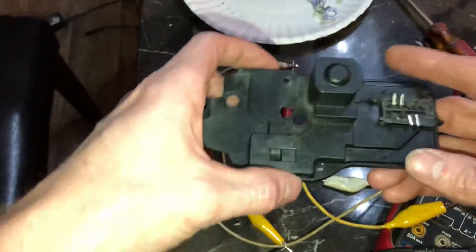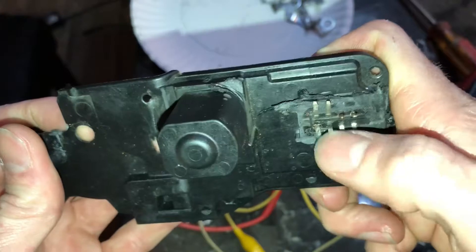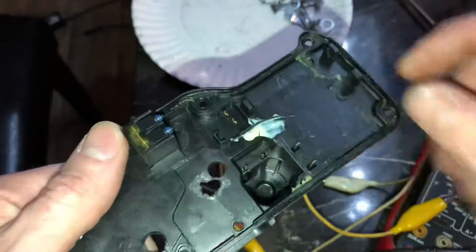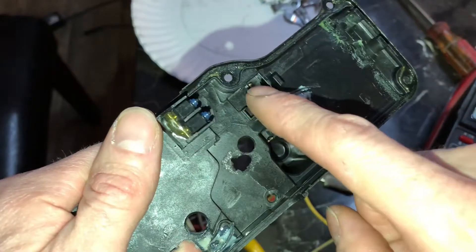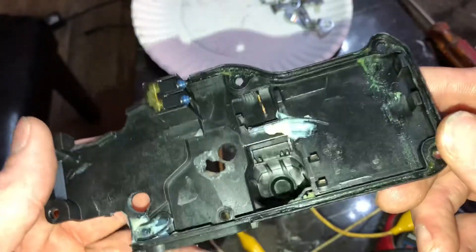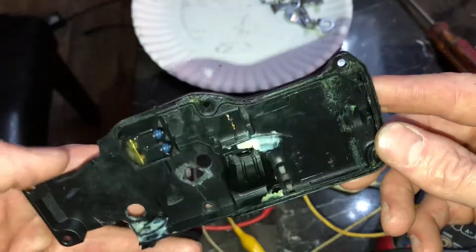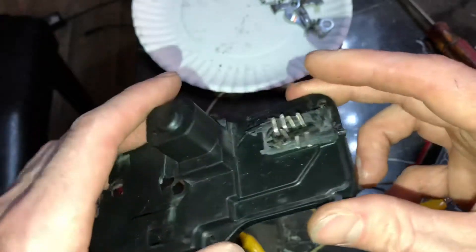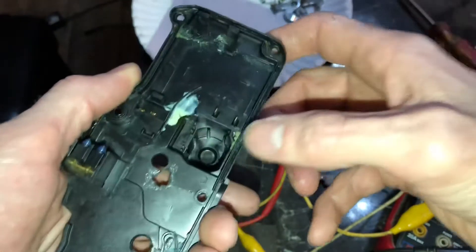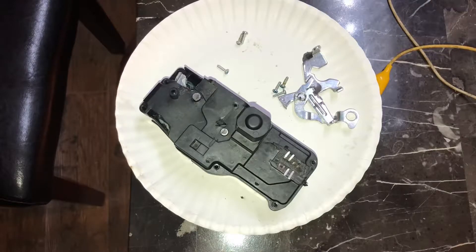It's going to be these two bottom left leads if you're looking at it like this — this guy and this guy. These two that I've got bent down all go to these two leads down in here. For the life of me I can't really figure out what those do inside of it, other than maybe if something were to come apart it would throw a signal to the computer. These two leads right here go to the motor, and I got continuity from those to these — I'm actually about to put this thing together and put some power to it, so stay tuned.